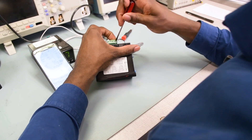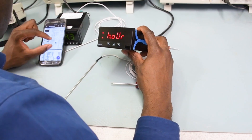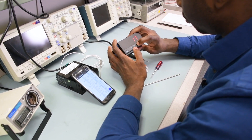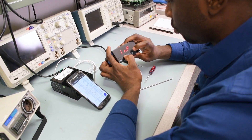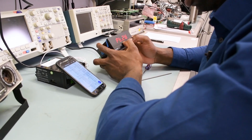We've already gone ahead and connected these RTDs to these meters. When connecting your RTD for the first time, make sure you follow the manufacturer's wiring diagram. Then you want to make sure that your RTD meter is programmed for the correct curve. Every RTD is different, so you've got to make sure that you follow everything precisely.